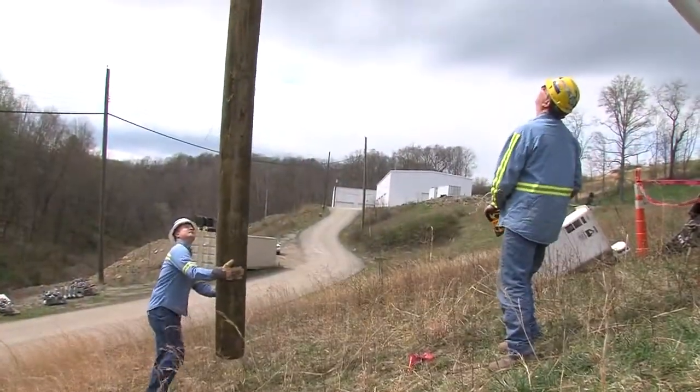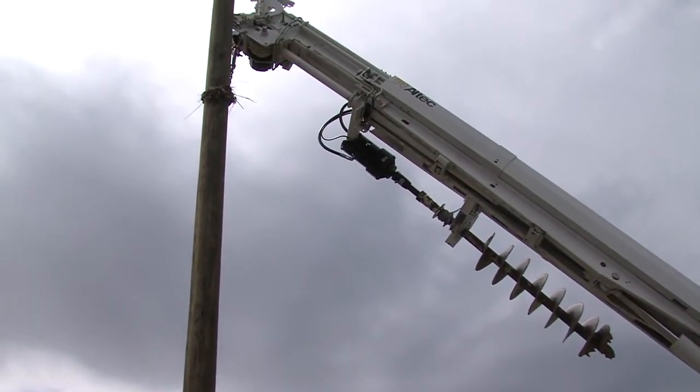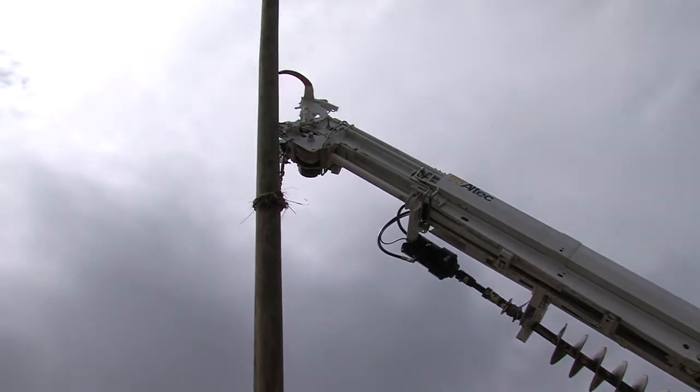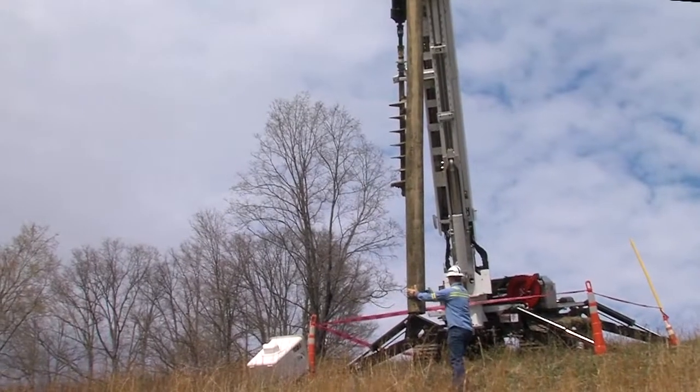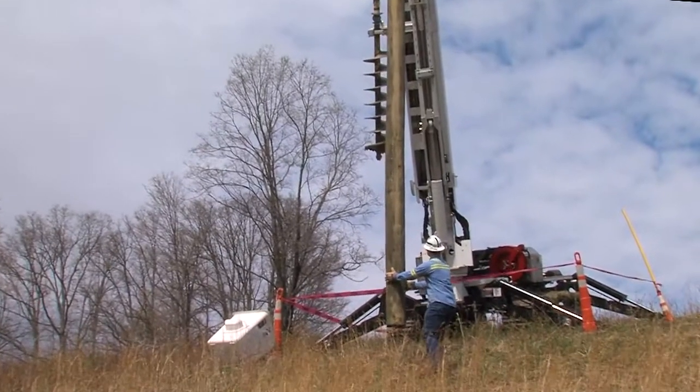When lifting, raise poles with the boom, not the winch. When using the boom, work as closely to the center of the machine as possible. When the boom is in line and over the hole, lower the boom and winch to place the pole.